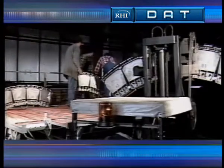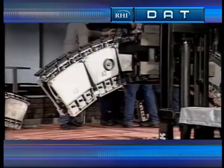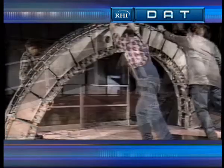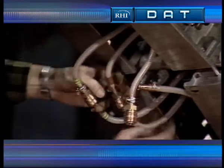The six middle elements of the formwork arc and the side sections are delivered pre-assembled — they should never be taken apart. Next, the formwork arc is erected without the side moving gear and placed symmetrically on the running rails. The moving gear is then screwed into place. The pneumatic cylinders are fitted together and set up.